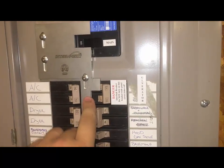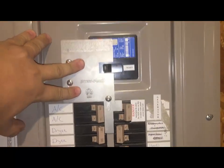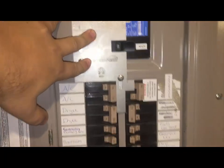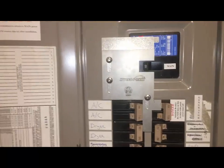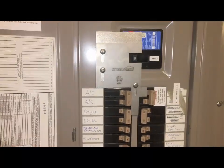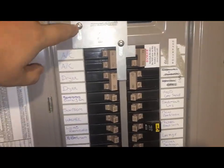Once this is engaged, the main is cut off, which means electricity can't backflow to the pole and potentially hurt someone upstream. This interlock kit is critical — you cannot legally backfeed the grid without it. If you just create a male-to-male socket from the generator and plug it into one of your outlets, chances are you will kill an electrician working a mile down from your house, because the electricity will go back from your house into the pole and get stepped up to 22,000 volts or whatever the transformer rating is on those pole-mounted transformers.